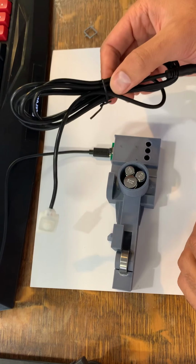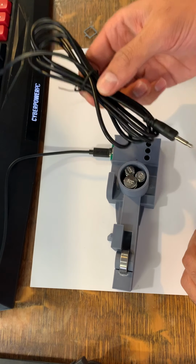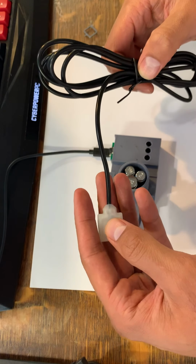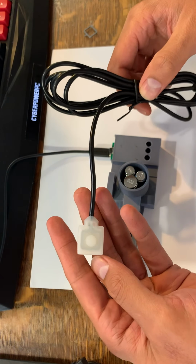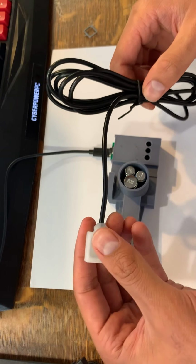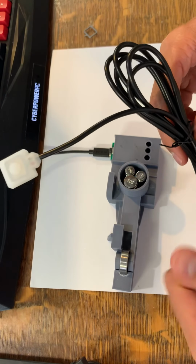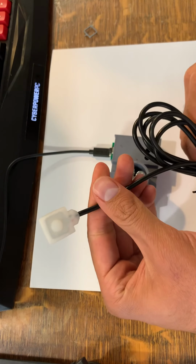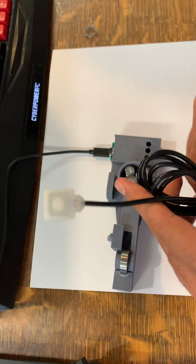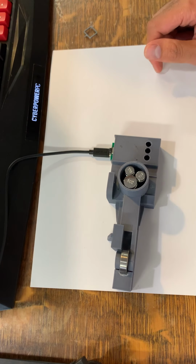This is a 40 gram. This switch passes our 40 gram test, and that passes our internal resistance test of meeting the requirement of a switch that's less than 6 ohm resistance on contact. Let's see if we can find another switch of a different situation and see if that one passes and how we handle that particular type of switch problem.